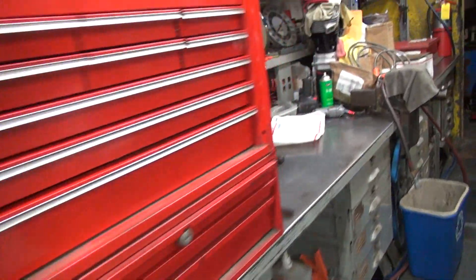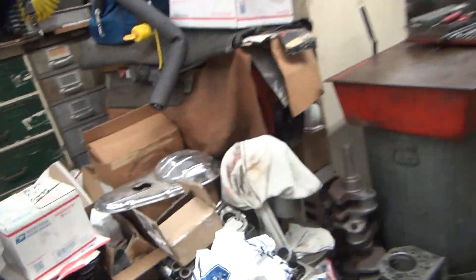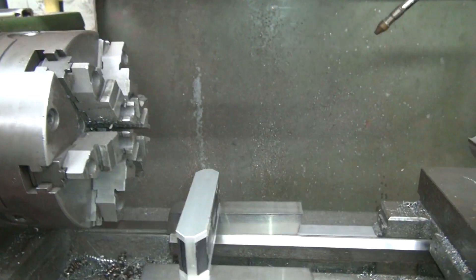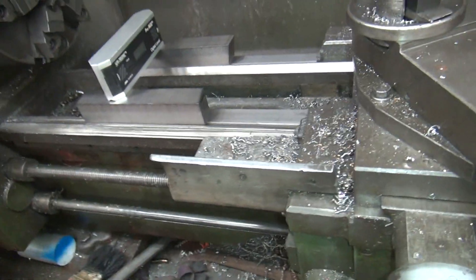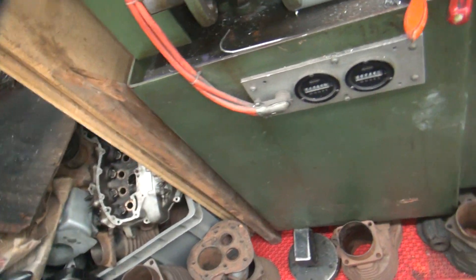So that corner is low — that could be a twist in my lathe. The way you fix a twist is you adjust it. Now if you have a twist in the lathe, your centers are going to be changing too. But when I set my centers, I set them right where I work all the time, and I made sure the center was out far enough where I'd use it most of the time — I was trying to eliminate variables. So the reading is at 44 over there right now.